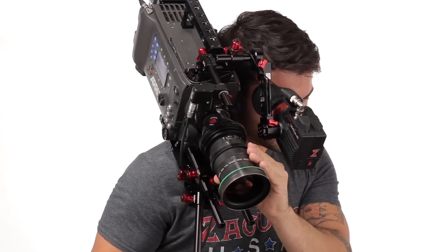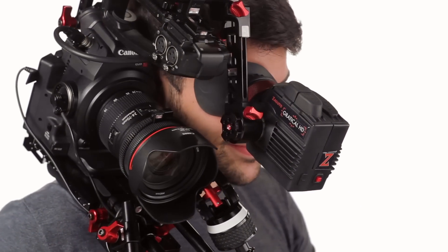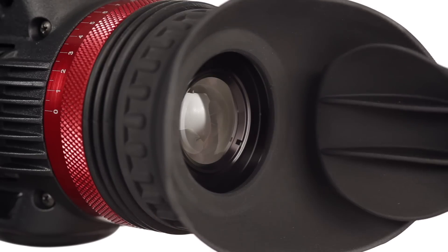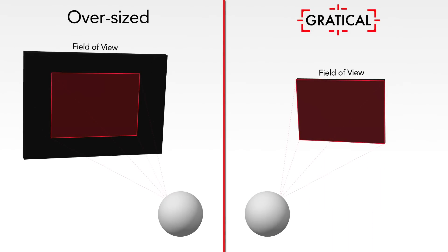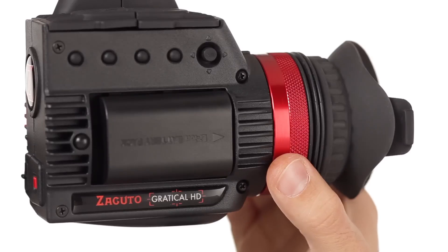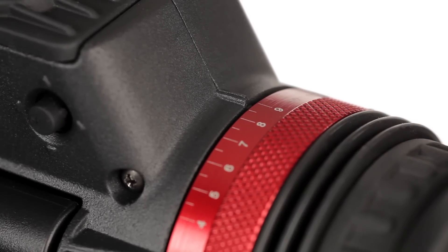That's what people noticed at NAB when they looked at it — it was so crystal clear. Contrast is important too because it is, first and foremost, a focusing tool. The optics are incredibly sharp because we custom made them from scratch, made for that particular screen. In the HD model, there is an enormous wide-angle view and a large eye box because of the size of the lens. But not too large — we were starting to hate how big some viewfinders were, where you had to really look around, fatiguing your eye and maybe not catching everything in the frame. We had literally thousands of people look through this thing, and I asked everybody how the field of view was, and they all said it was perfect. The diopter goes from minus one to plus four, and it has a very short range to turn — because it's a multi-lens optic system.